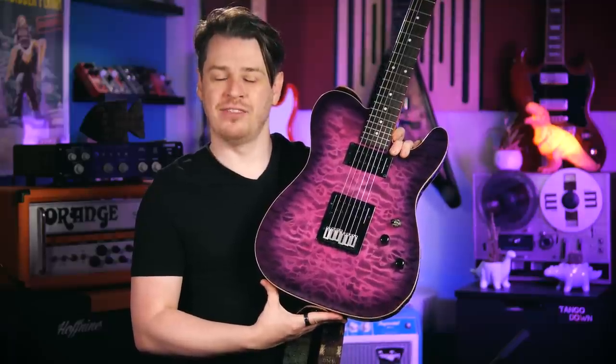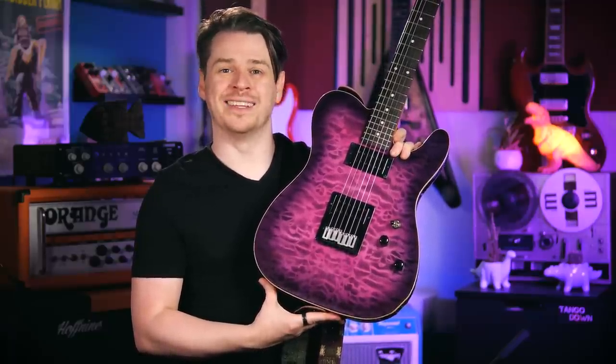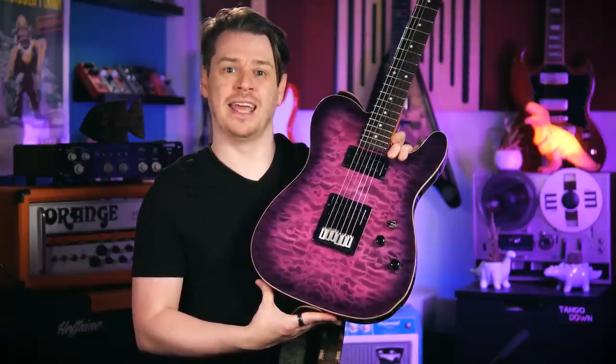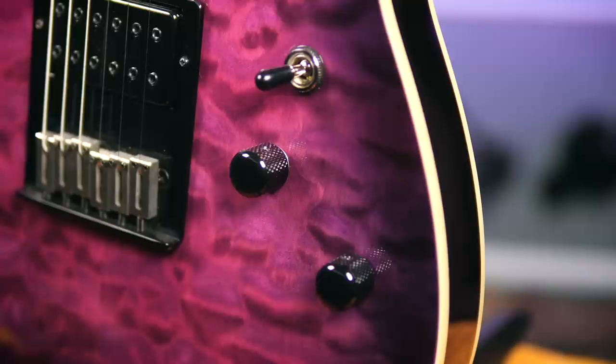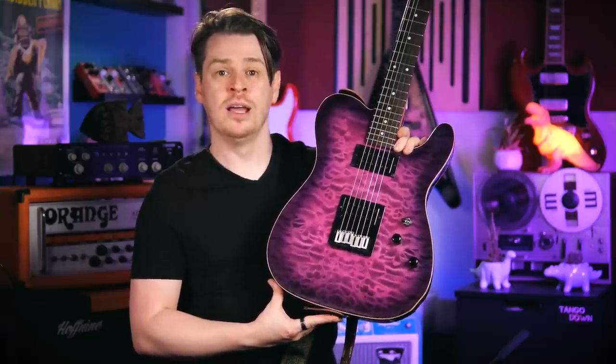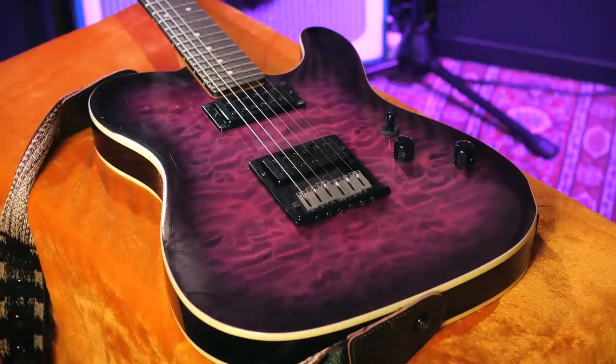The issue Scooch is having with this lies with the volume control and selector switch. The knob is noisy while the switch sometimes doesn't engage the bridge pickup. Someone else has already been inside this to hit the components with contact cleaner, and that's apparently done bugger all to fix the issue, so it falls to me to do an extraction and replacement of the problematic parts.